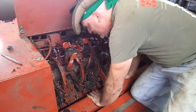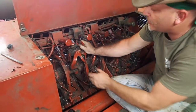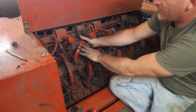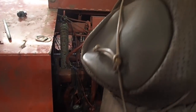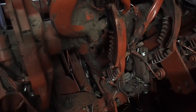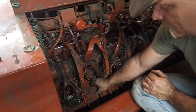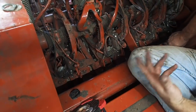So if you're having problems and you don't know what it is, maybe your knife arm isn't touching your bill hook all the way and it's just super sloppy, you need to readjust your knife arm. This is your knife arm. There will be some wear here from string, but these are still in really good shape. The other thing you're going to need to look at are the ball rollers at the back that follow the cam inside — if they've got flat spots or if they're not rolling, that can cause a delayed knot cut and it'll cause a mistie. And here are the tucker fingers — you've got to watch those connections, make sure that they are all straight across where they're supposed to be.